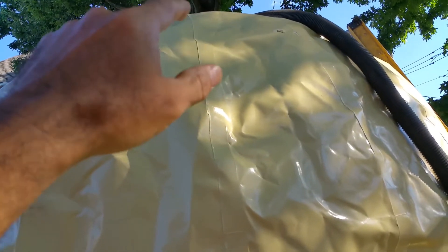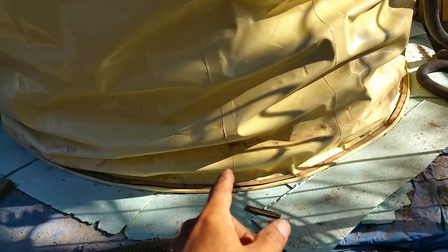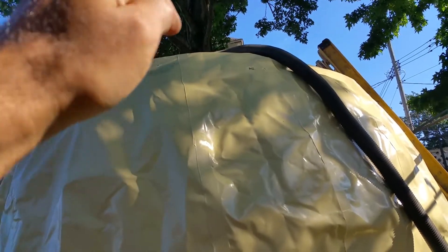I'll probably just go around with my orbital sander, vibrating the whole thing to get out whatever air pockets there are. Since the air is coming in from the top, I won't have to worry about it creating air pockets. Had I filled the dome with air from the bottom like I did the first one, the air going in would create a bunch of air pockets — and you wouldn't want that. That's the reason I'm filling the air in from the top and sticking the hose in from the top at the same time.